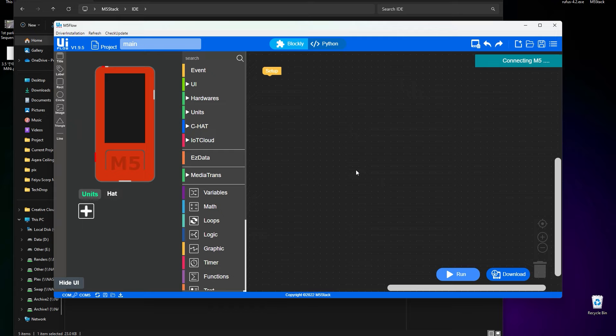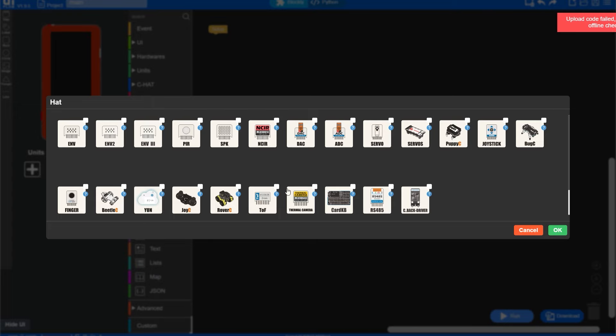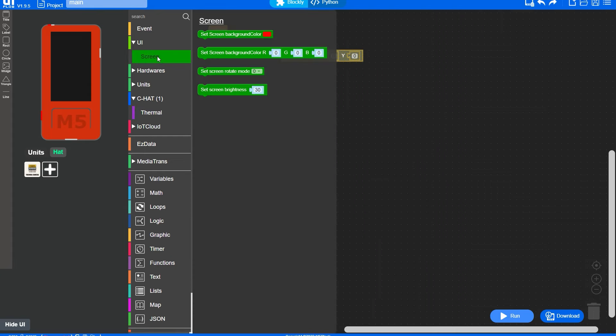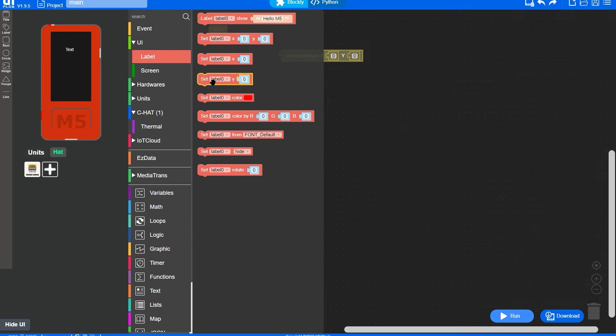Apart from local access, you can connect this to the M5Stack cloud. Using the key and MAC address of your device you can log in and obtain all that information remotely. You can also download the M5Stack IDE, which lets you wirelessly program the device using either a block interface or MicroPython, and add your own ways of processing and submitting data via REST requests to wherever you want.